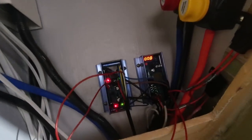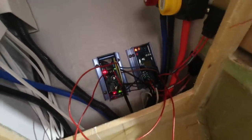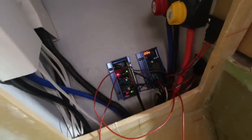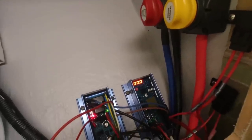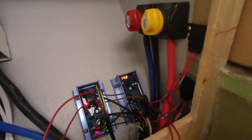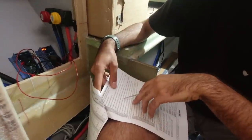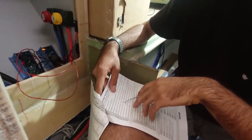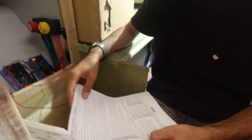The other side's actually working too, so we know both sides are working. Very happy to see that happening. I'm going to tidy all this wiring up at some point — this cupboard is going to be a no-hands zone. Belt load manager is zero. The calculated voltage target is 14.2 volts. 22 degrees for the battery, 20 degrees for the alternator. It's functioning properly.